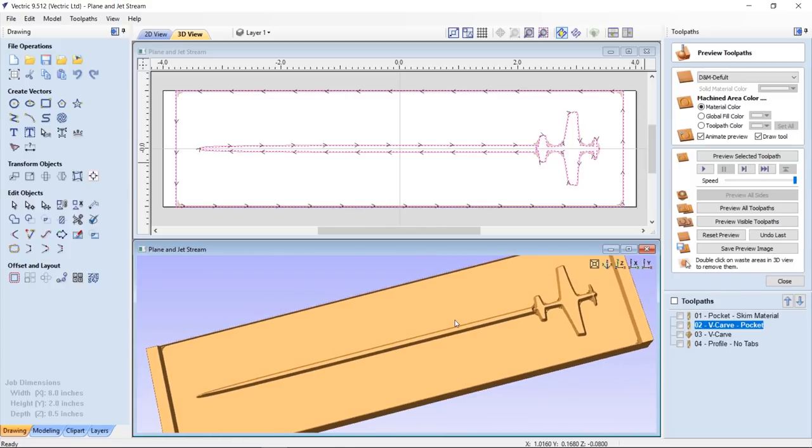Now you will notice, and I was surprised, that the flat areas here are actually wider than what you expect, and they're supposed to be wider than what you expect, because they should fetch up on the inside of the cavity, of the female cavity that you've made, before they bottom out.